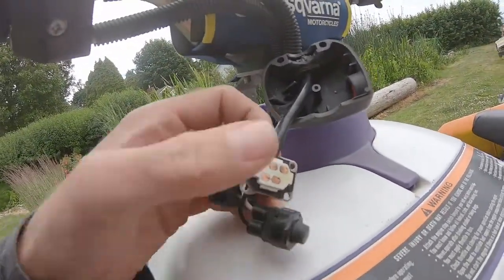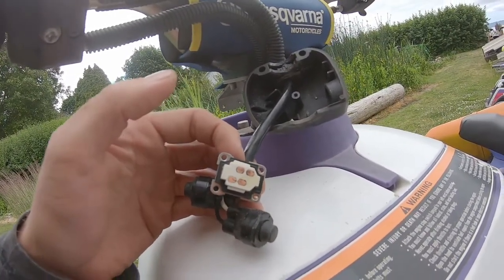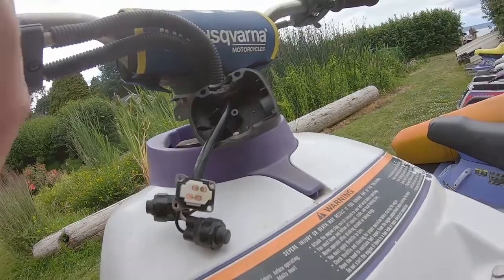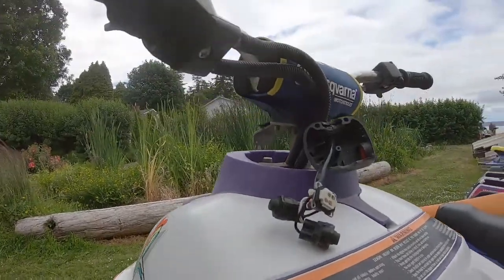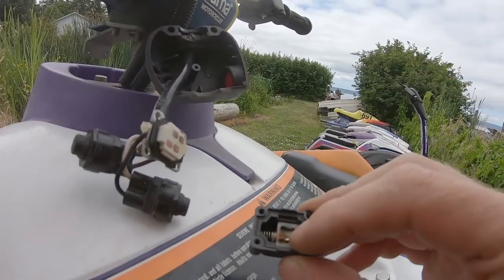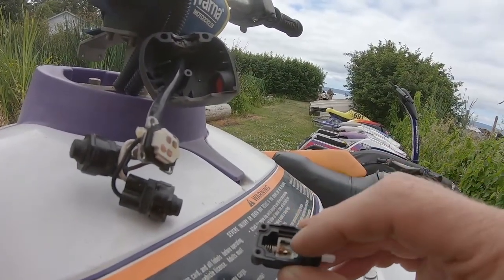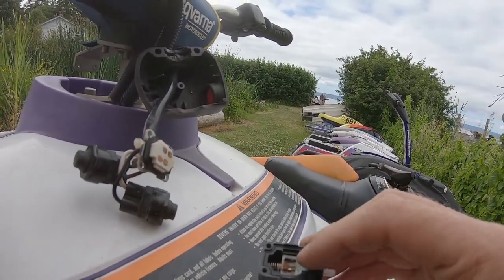You can see right on the other part there's a ton of corrosion all over it, and it's actually jumping those two terminals together when it's not supposed to. It's really simple to clean — if it just happened it's easy, just wipe it off. You could spray it with some electrical parts cleaner, but really just wiping it is all it needs to work. Also try to wipe up some of that junk from inside.